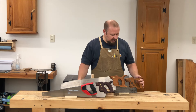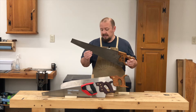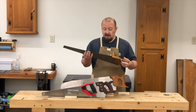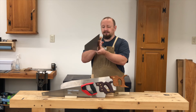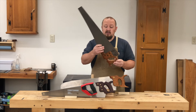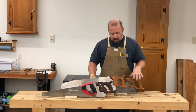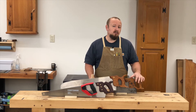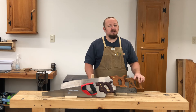Our last option is to buy a used saw. This is an old Disston D8 — a saw that was my wife's grandfather's and I keep it around for that reason. It's a saw that's in really good shape; I think he bought it new and it's straight, the teeth are well shaped, they do need to be sharpened, but the saw was pretty well cared for and only needed a little bit of cleaning when I got it. Old saws can be a great way to go, but if you're not certain what to look for, they can be a little bit hit or miss. The price of old saws can range greatly.